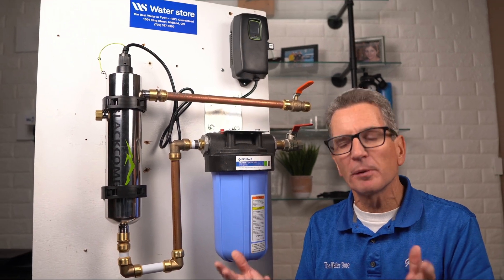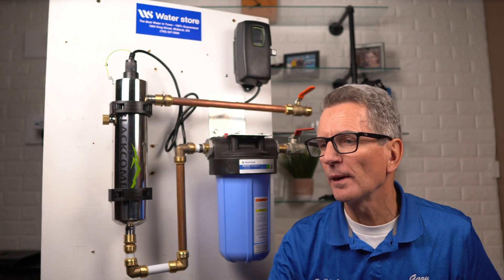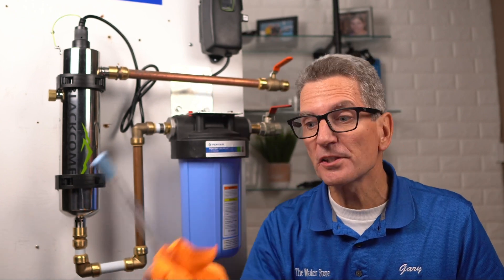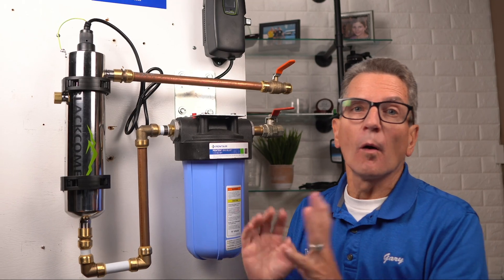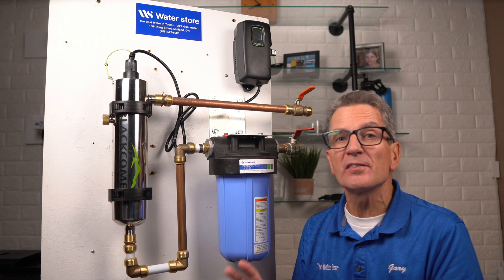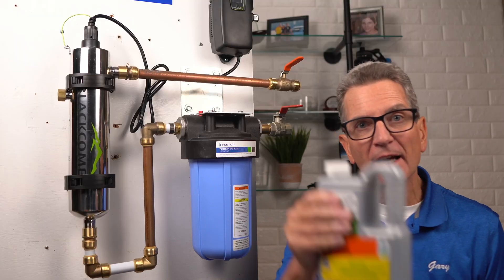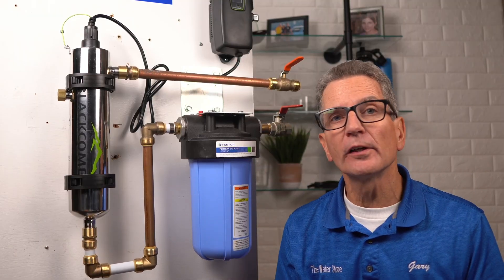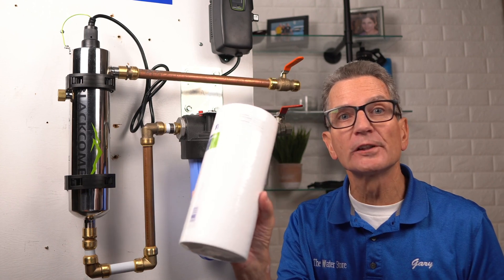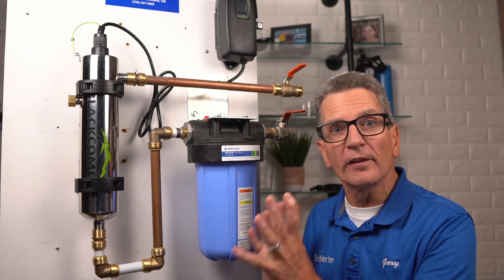Before you begin, you're going to need a few supplies. You're going to need some nice clean cloths, a filter housing wrench to open up the filter housing, rubber or latex or even cotton gloves, a Phillips screwdriver, a replacement lamp, and I also suggest you have a replacement sleeve on hand. The sleeve only needs to be replaced if you can't get it perfectly clean or if you end up cracking or breaking it. Because the sleeves are pretty fragile, I always suggest you have a spare on hand. You're also going to need a cleaning product like CLR, Lime Away, or even vinegar to clean that quartz sleeve, and a replacement filter. I recommend these 5-micron filters — they're a great solution for a pre-filter for the Luminor UV systems.